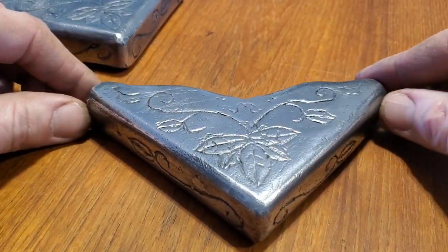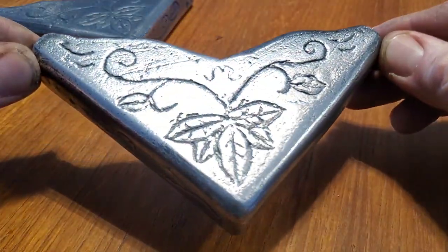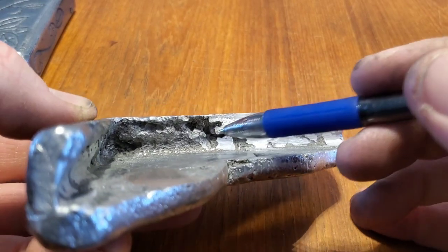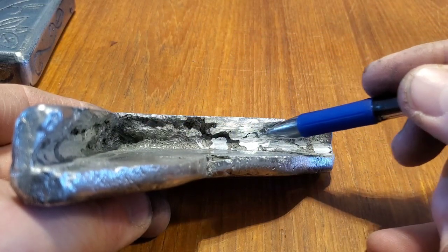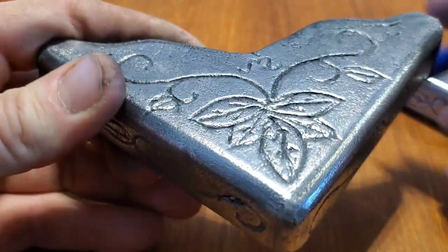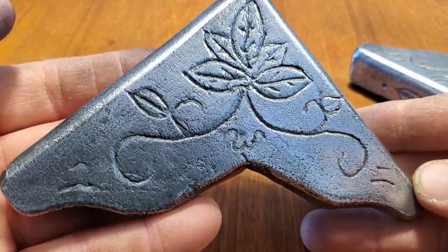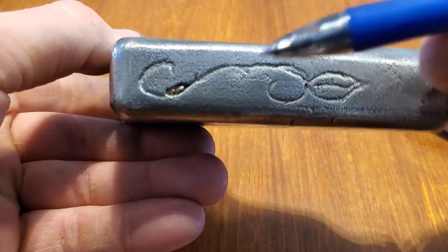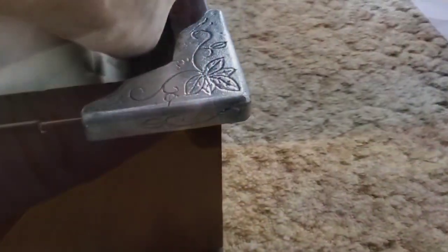Let's do a breakdown of the part. The outside surface looks really good. Luckily, this is just a cosmetic part. As we flip it around, there's a few problems that could be pointed out. The first part was due to a little bit of moisture. However, this valley I'm pointing out now was due to the two metal surfaces coming from different directions and coming together at the same time — because the two oxidized layers coming together won't bond together properly. Sometimes you can have a perfectly good casting and those laminate layers are folded together inside, and that'll be the source of a crack later on when you need it most. This part here was simply just the casting being too thin in the foam. Hey, if you like this video, hit subscribe. My next project is going to be making a 7-inch hand wheel for my surface grinder, machining it and installing it.